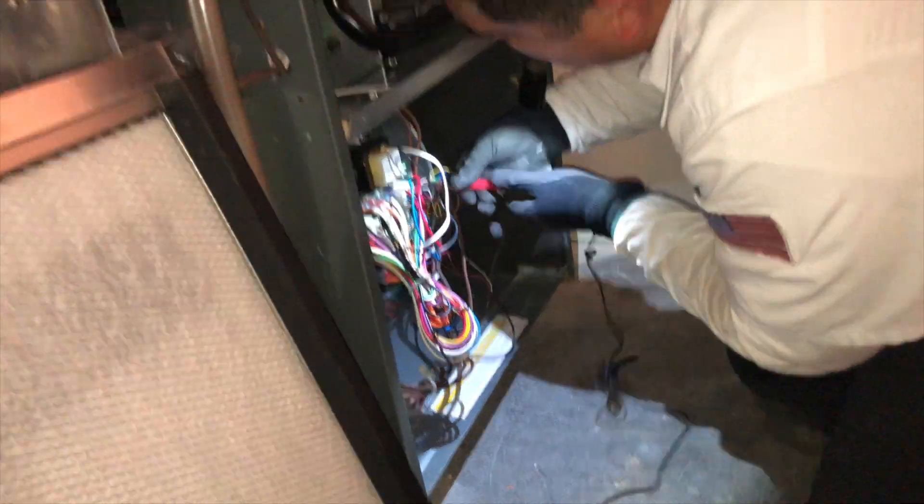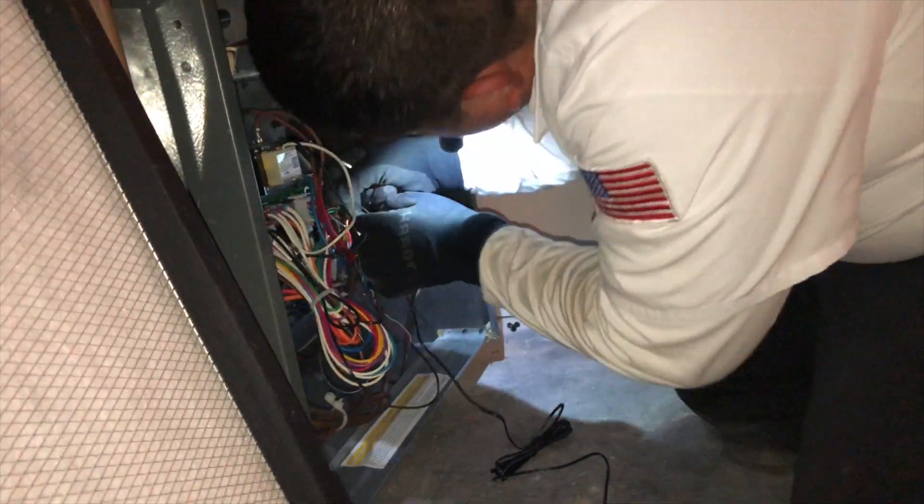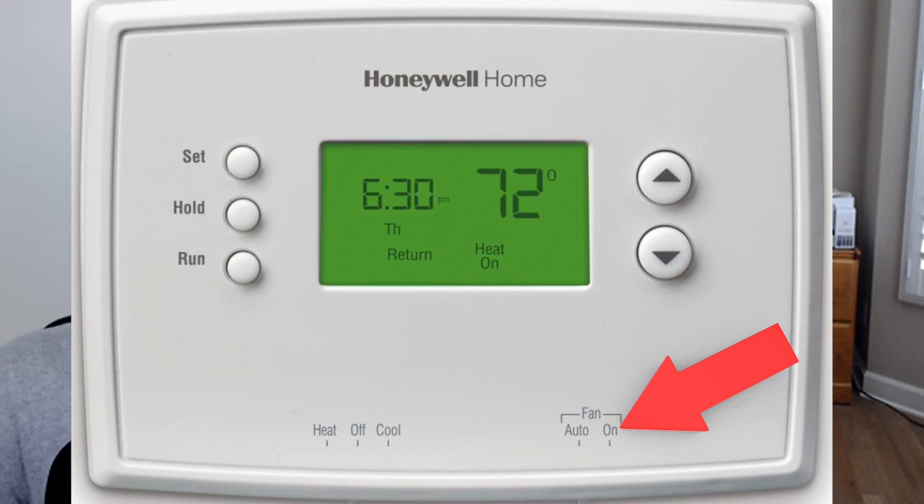How do you get one installed? Sometimes we can install them right into your existing filter slot. They come in standard sizes, and we can even special order them in something unique or unusual. It's very helpful to run the blower continuously — that's why we're a big fan of variable drive furnaces, but even conventional blowers work. You could have an incredible air cleaner, but if the air isn't moving through it, it's really not doing anything. A typical house changes over all of its air six or seven times an hour — the air is gathered up, run through the air cleaner, and put back in the house, so it's very effective.